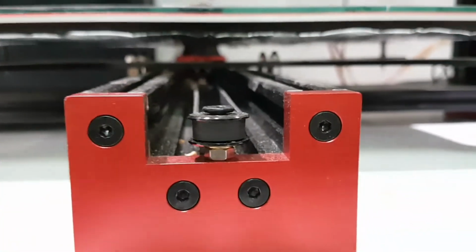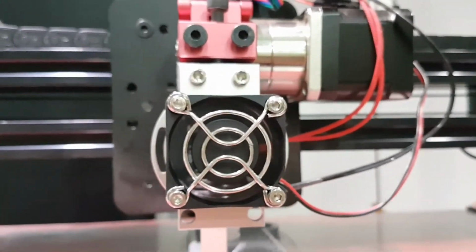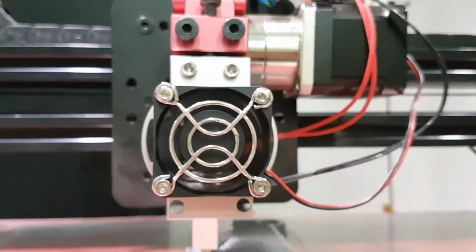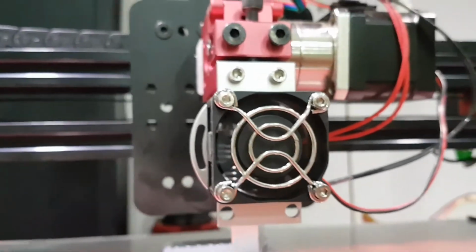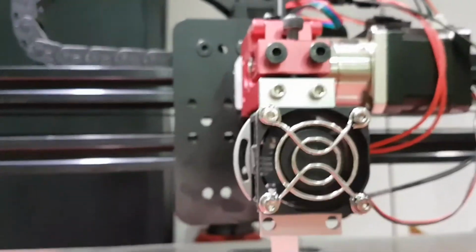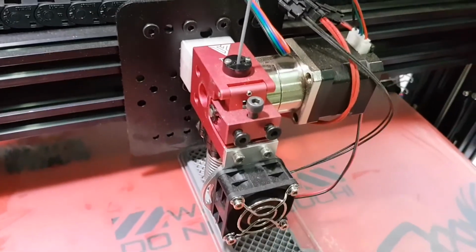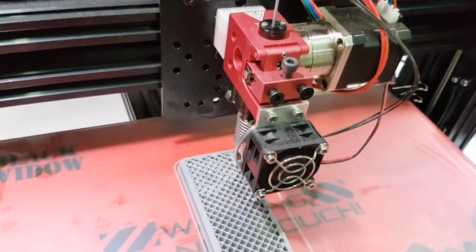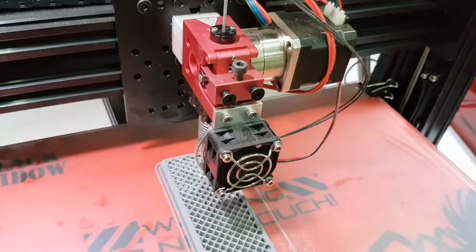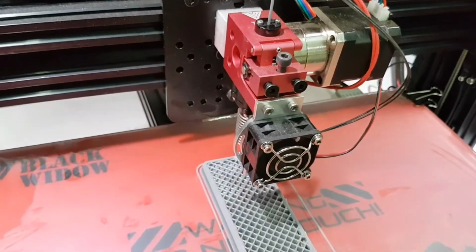So I guess the only little criticism I had was they hadn't quite resolved the mounting of the print head. Not hard to overcome though. You could dial up your own spacer, that's all I needed to cure that. There was a couple of screws short, naturally, because the screw lengths they provided did not allow for that spacer. But basically the threads are like 3mm and 5mm and 4mm, so there's nothing impossible to get off the shelf elsewhere. And funny enough, the bits I was missing on this were supplied in excess with my GTAC Cruiser. So basically the spare parts bin of the other one managed to let me finish this off nicely.